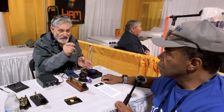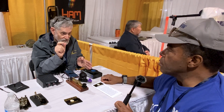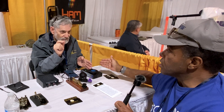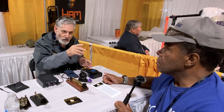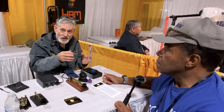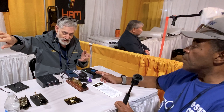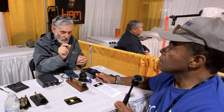Think of it basically as a very, very narrow tunable filter. There's relatively straightforward electronics which are very good at filtering out a single tone — adjustable for the frequency of that tone — and the front end has an adjustable sensitivity. Ambient noise or talking wouldn't cause it to vibrate. It's designed for use with radios tuned in, so background static, a CW signal that's a little off frequency — the filter is always working and always very, very narrow bandwidth.